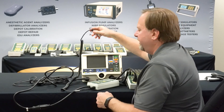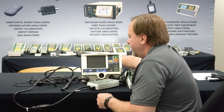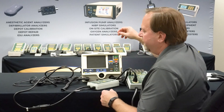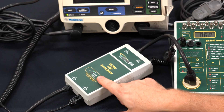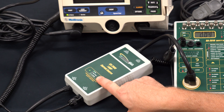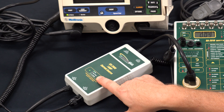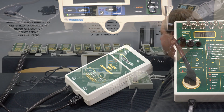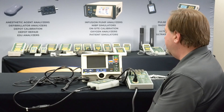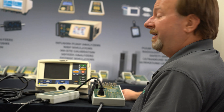Now we're going to connect the CS2000 quick cable to the ground lug on the back of the LifePak 20 and measure resistance in that mode. I push to test and get a reading of 0.09 ohms. Subtracting all the offsets gives a measurement of 0.01 ohms for the total measurement in the circuit, which is underneath the limit of 0.2 ohms specified in the test procedure.